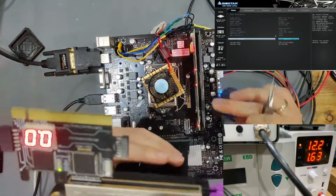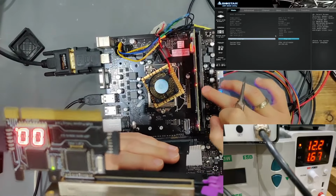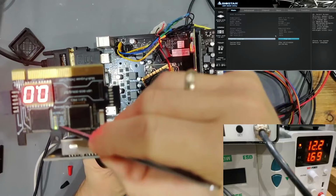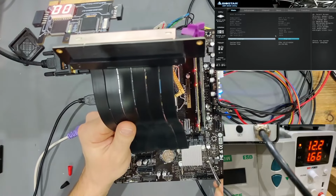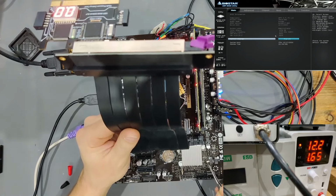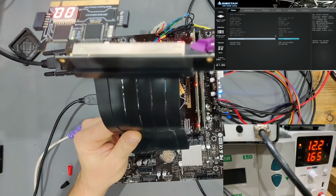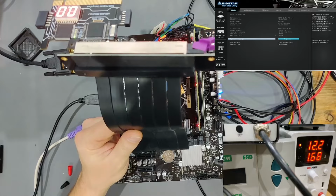And before we didn't have picture, and the simple reason was because of the RAM stick. The RAM stick, in the first slot, wasn't recognized. So all we had to do was to try to fix the 3 VSB. And what I haven't shown you, there's a small fuse down here, a poly fuse, that was also a 3.3 one that was blown. And I didn't replace that, but I just bridged it. It is close to the BIOS chip, so I think that might be something related to the BIOS on the bottom right here.